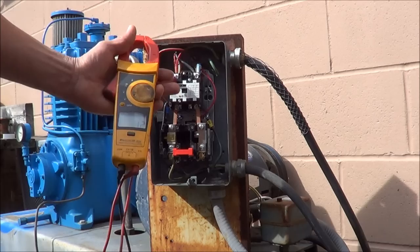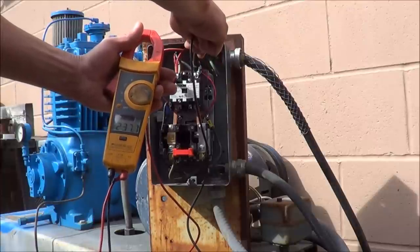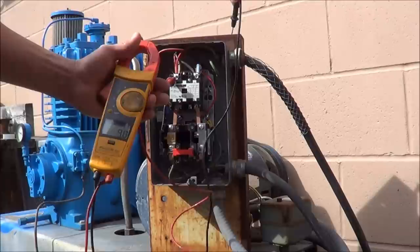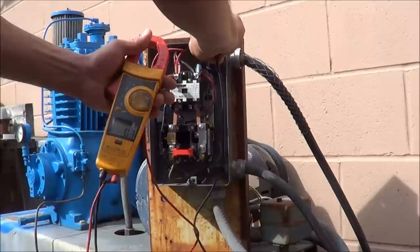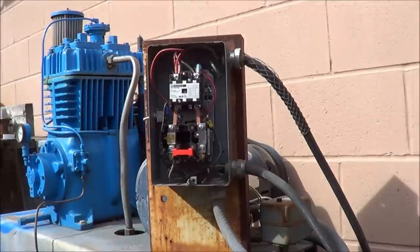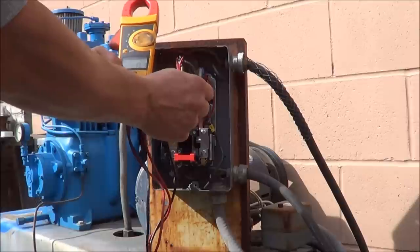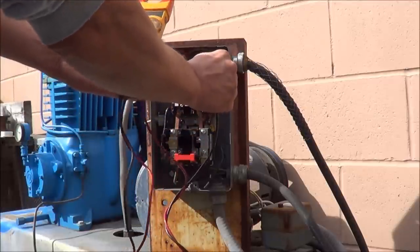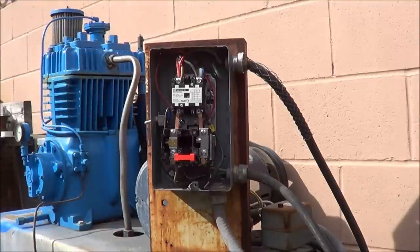So I'm just going to check power here — pretty simple and basic. L1 to L2, we've got 237 volts, fluctuating a little. And like I said, if you take one side of 230 volts to ground, you get 120 volts — same thing on the other side, 118 to 120. Now I'm going to disconnect the power and show you how this is wired in. After disconnecting, always check again to confirm you're at zero, checking each leg to ground separately — because sometimes a breaker may not open all the way and leave one leg still attached.